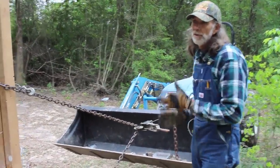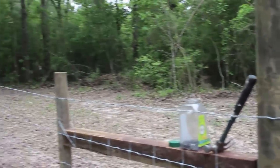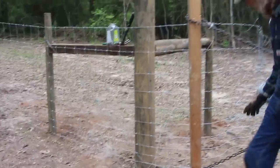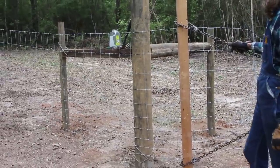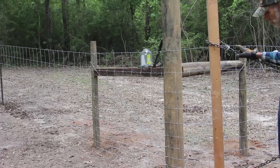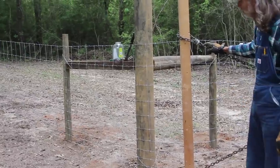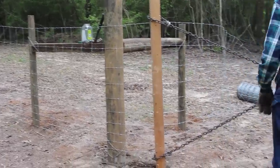We've got our fence clipped all down through here. What we've got to do right here is our wire is pulled up a little high on the corner — we've got to drop it down. That's because the chain and the two-by-fours are on this here. So what we're going to do is ease a little bit of this tension up. We've got it nailed to that first post right there, and if it starts letting too much slack off, we'll have to tighten it back up and nail it where it's at and fill that back in with dirt. But we're going to try to ease this off one click at a time.